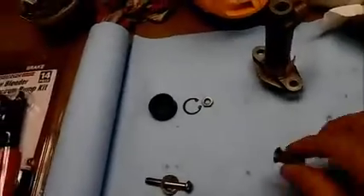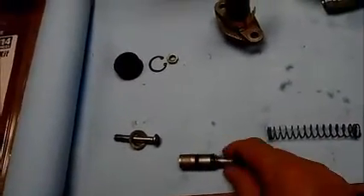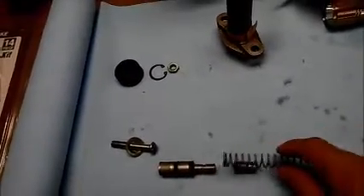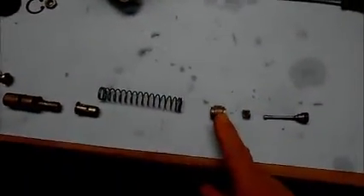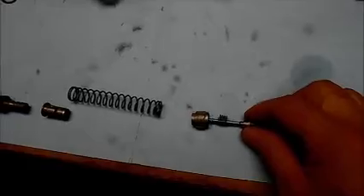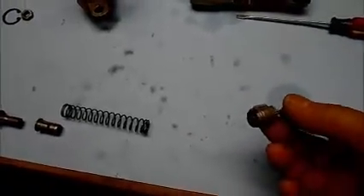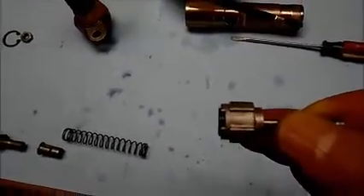Technically, this piece slides over the end of the piston and then that tang gets pressed down so that it is now fixed permanently to the piston's motion. That spring is acting on this flange here and on this little housing here. The spring I was talking about is this little guy which rests inside this housing — so if I put it together you'll see it goes like this. That little assembly then forms the part that sits down in the tip of the piston.